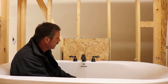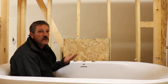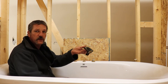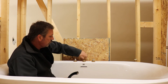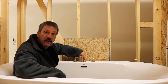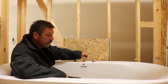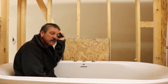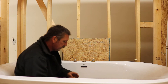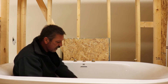I'm going to take the trim off this valve to show you how it looks at the rough-in stage. Taking the trim off — the trim is pretty simple. The spout has a little Allen set screw in the back. When putting this on, remember there's an O-ring right here. If that O-ring is damaged, it could cause a leak when the tub is running, and it'll leak down into these holes and might look like something other than just a simple O-ring issue. Sometimes the rough-in part comes in twisted and the spout doesn't sit all the way down, which also causes a leak.